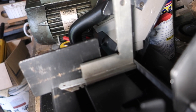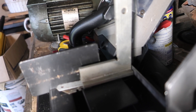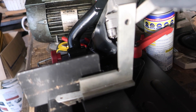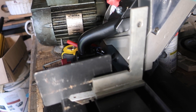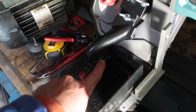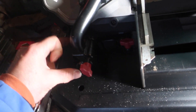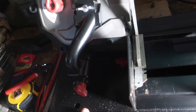With the back end of the square jacked up using standard packing materials — a Stanley knife blade and a bit of hacksaw blade — we can actually get pretty much square all the way up. What that means is that although the blade is not square with the base of the vise or the base of the base, it is square with the axis of rotation of this arm. Which means I don't need to make a new arm — all I need to do is change the way the arm is supported, put it onto something that is a bit more square, and we should be able to get square cuts.